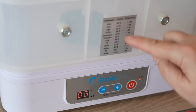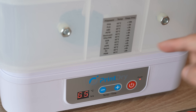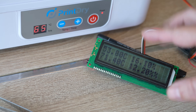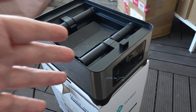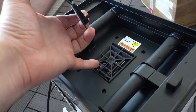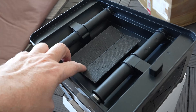This could be too much for PETG if it receives that direct hot air. I would suggest to PrintDry that they provide at least an STL file for a different fan shroud that better protects the spool from direct hot air. This problem is not new — I already saw it with another filament dryer where I had to print a part from nylon because the air was too hot. I can see that newer units now ship with this shield but my unit arrived without it, so I have to print it myself.